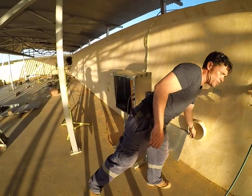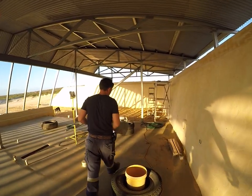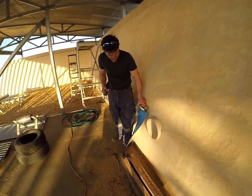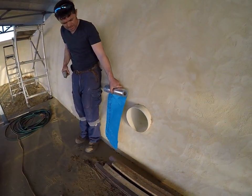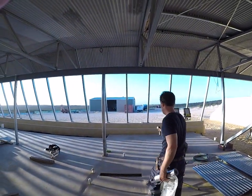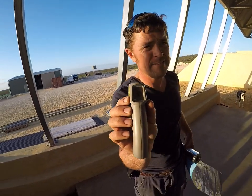The earth tubes are still working — they've been working really well. Let me try to give you some type of demonstration on how these tubes are working for us at the moment. The building's not closed in yet, so this is purely the wind from the back side of the building. Can you see it? That works quite well, doesn't it? Inside it's 23 degrees, and outside on the outside wall it's 30 degrees. So the tubes are working — we're quite happy with that.